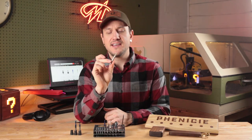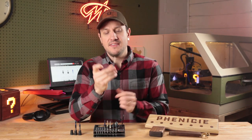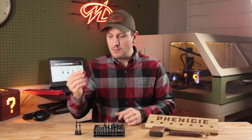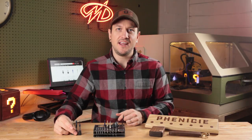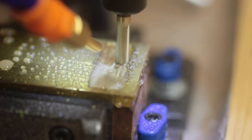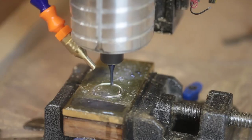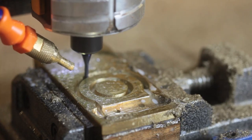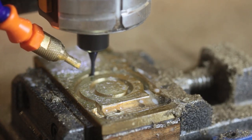To mill the brass for this project, I used a bit that is zirconium nitride coated, and it's specifically made for metals — it gives it a little bit more strength and also reduces friction and heat. I cleaned out this pocket that works as a half lap joint first, and then made the screw holes and cut the outline with an eighth inch end mill that did not have the ZRN armor, and I did have to run that one much slower, which I'm assuming is due to not having the coating.